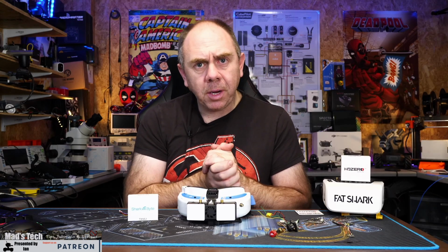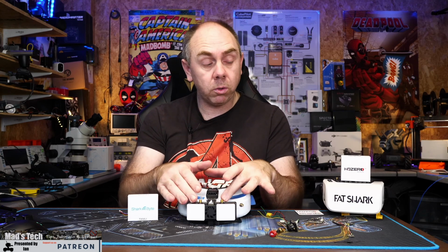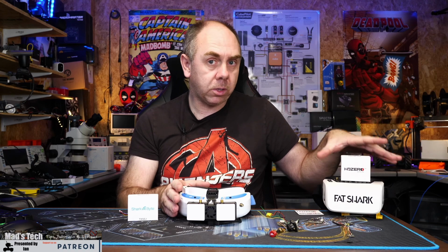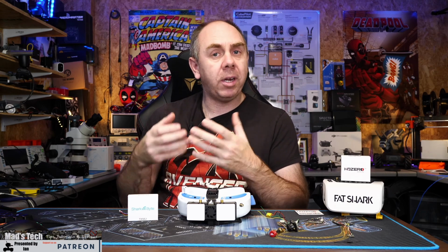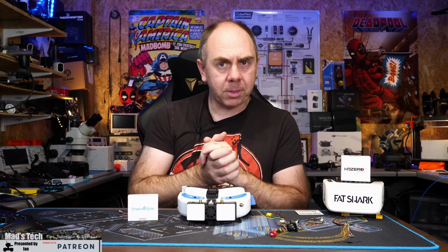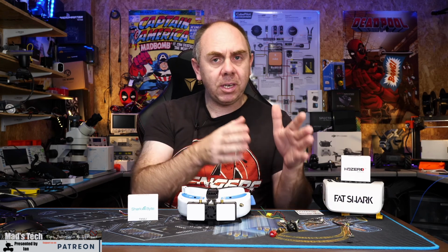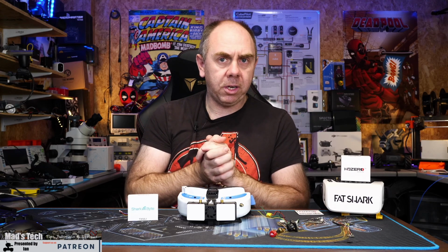Okay, so the update process for HDZero is actually fairly straightforward. There are though two steps to it. You first of all need to update your receiver side, so either your goggles module or your HD goggles like the Scouts, and then you update your VTX. The process is that you download firmware files from the HDZero website, place them on an SD card, and for the goggles, simply put the SD card in and allow the update to complete. And then for the VTX, again, download the firmware files, place them on the SD card into the module.